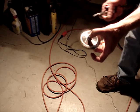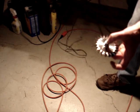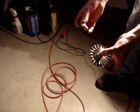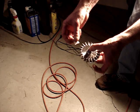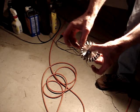Here we go. Your hand will tell you if it's in balance or not. What you'd want to do is take a small piece of cloth tape and put it at any random point on the turbine to see if the vibration decreases or increases — just like that.